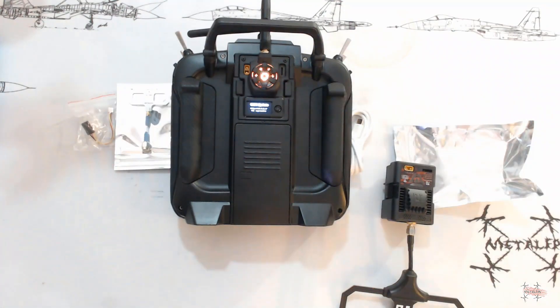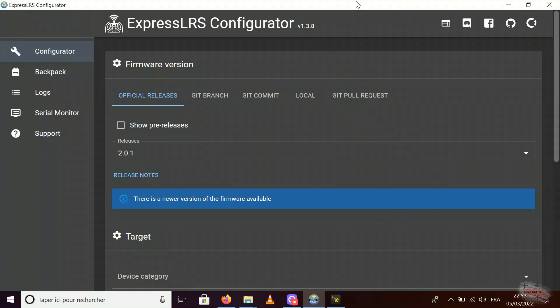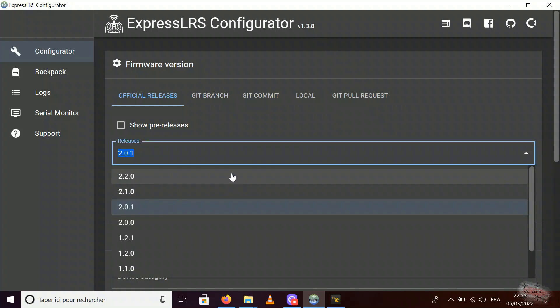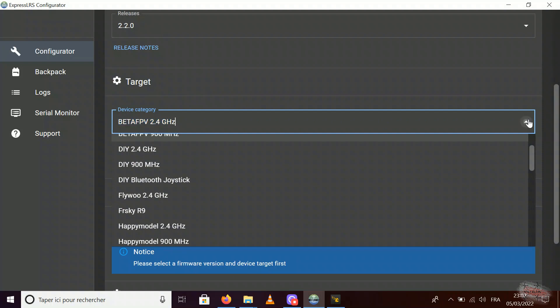I've set it into Wi-Fi mode with the joystick and I'm going to do the update now. You want to update to the main fork because the hardware is fully supported by it — it's not obvious that BetaFPV is going to continue improving their own software version and give you all the bug fixes and everything the ELRS team does every day. This way you get all improvements in real time. We want version 2.2.0 or at least 2.2 to get the full functionalities of the OLED display and joystick.